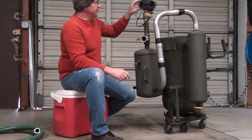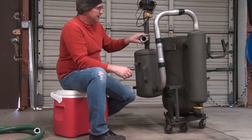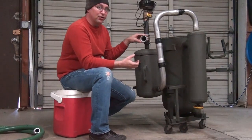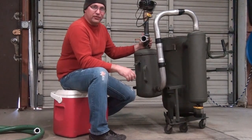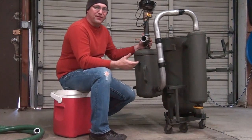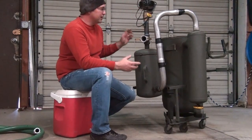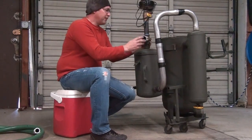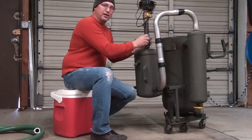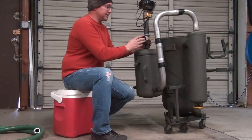This is a cam lock fitting - I bought inch-and-a-quarter coming out of here, with an inch-and-a-quarter valve to my fan. One of the mistakes I made - Josh said it in his video but I didn't catch how important it was - is whatever plumbing you use from here, make sure it's bigger than the diameter of the carburetor you're trying to run. I had three-quarter-inch plumbing all the way to my generator and just could not get it to fire - it would barely run. I tried so many things including a whole new filtering system and different fan. It was such a simple fix: I took the three-quarter off, put an inch-and-a-quarter on, and it fired right up and runs perfect. Make sure the port on the intake is smaller than your supply line.